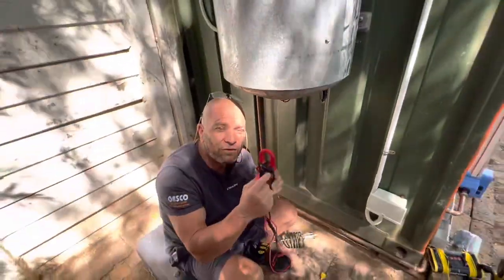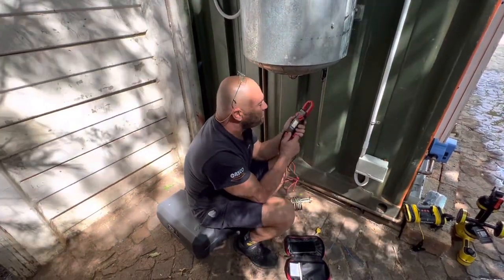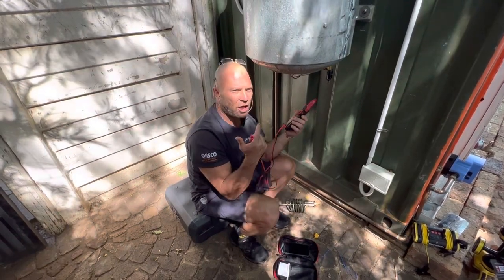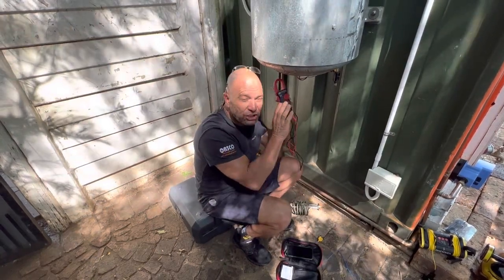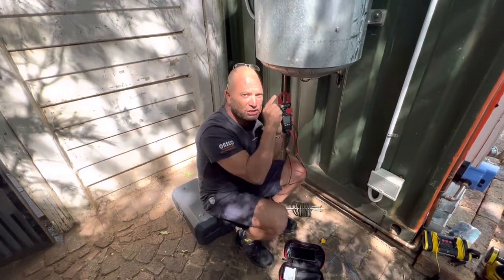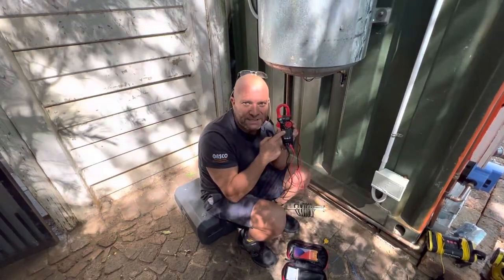When we do the next video on utility location and how to use this device to find drains and pipes, you'll see that understanding the flow of electrons is incredible — it opens up your mind. As a person working on a geyser, I'm not at all saying that plumbers should be electricians. We are merely doing diagnostics. You are not doing an installation, you're not rewiring anything — you're merely diagnosing your cylinder. You've got a finger on the pulse of this cylinder: you know the flow rate because voltage is pressure and amps is flow rate.